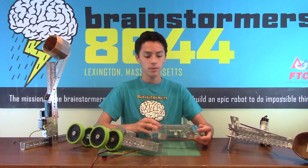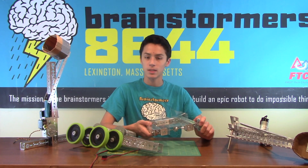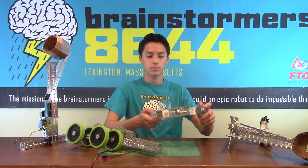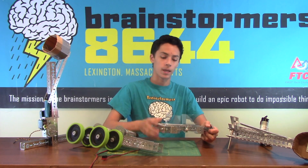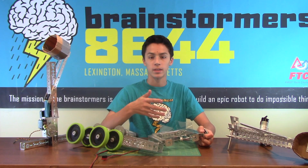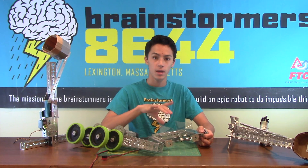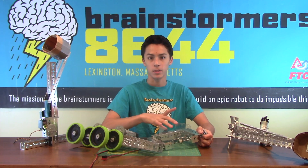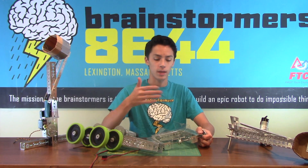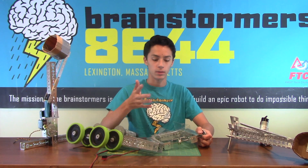With the popper it's another sort of continuous system because the motor is just rotating in one direction and then you're basically primed and shooting again. One disadvantage is you don't have any distance control because you're just relying on the mechanical flex of a piece of material. But you also have good accuracy because you're going to have a consistent shot every single time.